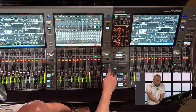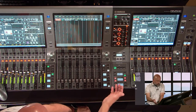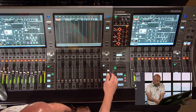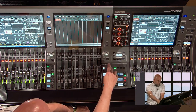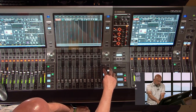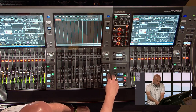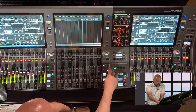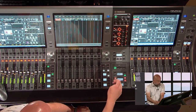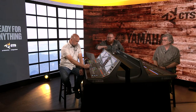It's pretty natural workflow and will feel the same as before — you've just got twice as many inputs. For custom fader banks, where you had two banks of six before, now you hold the custom button to enter custom fader bank selection, scroll through banks, and there are five banks with six options each — so 30 banks now instead of 12.